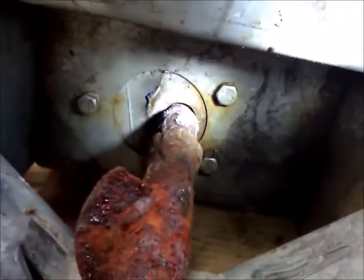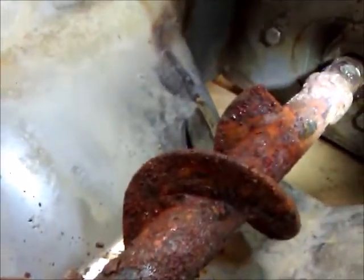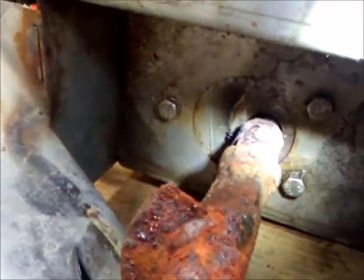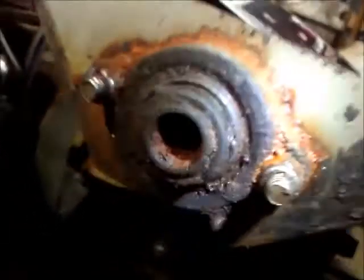So it gives me a problem. I can either flip this unit over and start drilling it out, but if I do that it may still seize this whole auger mechanism — the assembly where it goes through that shaft might be rusted and seized into the auger itself right where they join. That's going to be a tough thing to get out of there, so it could cause another problem. At this point I'm going to go to Plan B: come down to this end and hopefully loosen the set screws on the other end of the bearing auger.